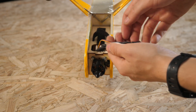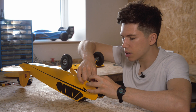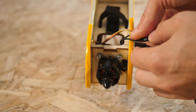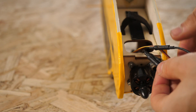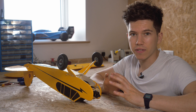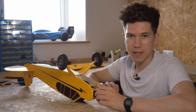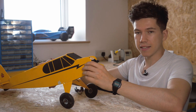There are three wires that come out the back of the motor and go into the speed controller. If they've got bullet connectors, all you have to do is pull them apart and then put them back together again in a different order. Just unplug two of them, swap those around, plug them back together again, and you should have changed the phase of the motor by doing that. The ESC is now going to be telling the motor to go the other way because the phase has changed. And that's all there is to it.